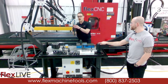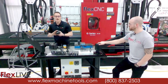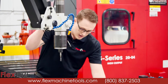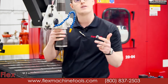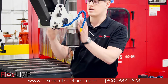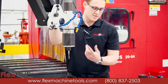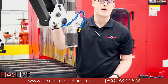And there you have it — as simple as that. I'll show you the quick-change here as well, going from an inch and a half down to a 3/8 in no time. I can also turn this to our second gear to speed it up. It doesn't require as much torque to tap 3/8 as it does an inch and a half, so you put it in second gear, and now we can increase the RPM. This is 265 RPM, while at an inch and a half we were running at 50.